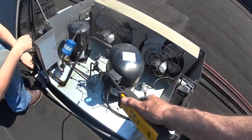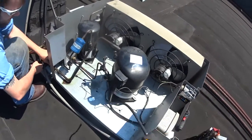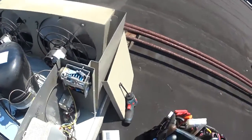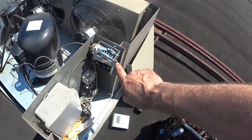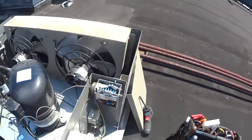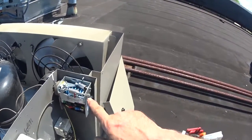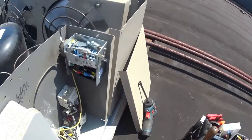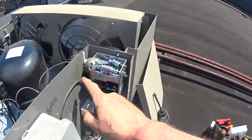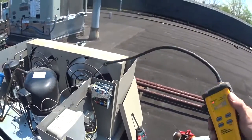I don't particularly like the way this is run like that because of the vibration - they tend to crack. But I found that if you can see there's oil here... the leak detector picked up some gas. See this oil here and the fuzz? It's a telltale sign. You can see it's a little oily all around here and my leak detector confirmed it.